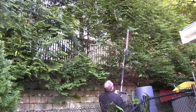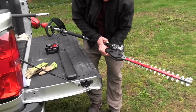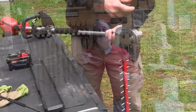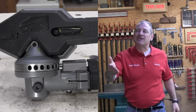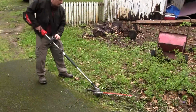We liked that the Hedge Trimmer head is adjustable. So the whole head articulates, and it articulates 270 degrees in rotation, but actually has a 180 degree operational position, and they give you 13 fixed positions. One interesting feature about the Hedge Trimmer is the adjustable head can be used for ground clearing, and you can use that on cutting perennials, trail cleaning, fall cleanups, and just heavy underbrush clearing.